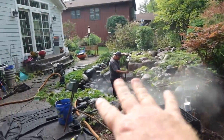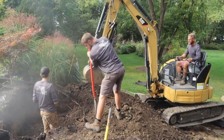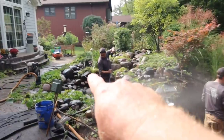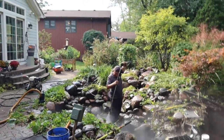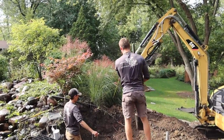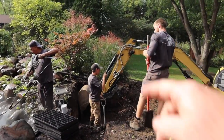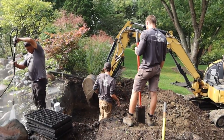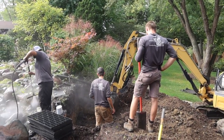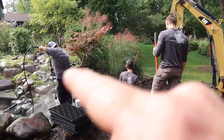Really, we don't need more than three guys to build a bog filter: one guy in a machine digging, two guys cleaning up the shelves and directing, and one extra guy doing the pond clean-out. If you were doing it by hand, three to four guys would be all you need. I've got this billed out as a one-day project and I think we're going to be pretty accurate. It's about 10:15 and we've almost got the whole bog dug — we'll easily have it lined and ready for rock and gravel by lunchtime, then out of here by three o'clock.